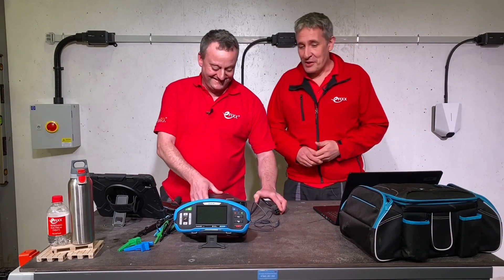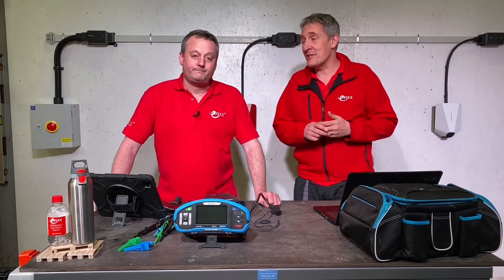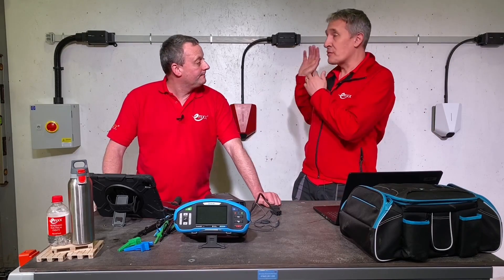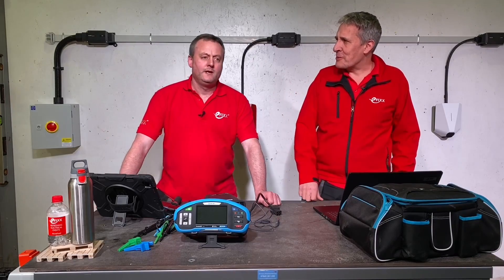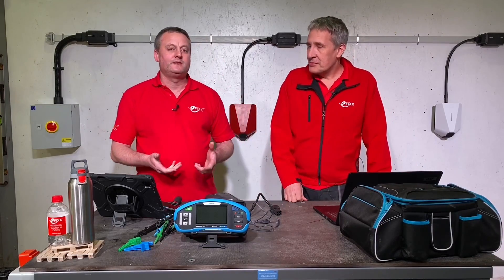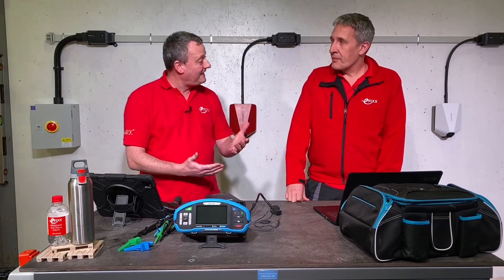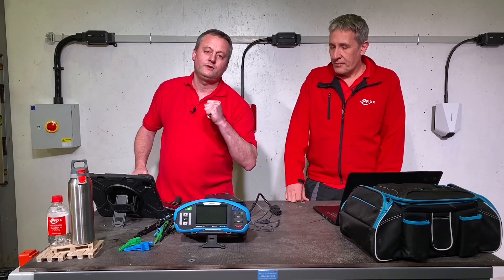A bit of role reversal today - I've had to learn some new software so Gary can have an easy life when it comes to doing the insulation test on this EV rig that we built behind us. Now obviously this is a three-phase system, so normally you'd have lots of swapping of probes, Gary, wouldn't you? Yeah, 10 tests to do the insulation resistance test if you're not linking live conductors together and doing it to a protective conductor. So there's 10 tests to be carried out, and we believe this three-phase active switch will make electricians' lives easier.